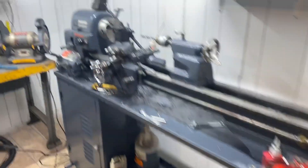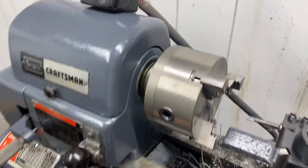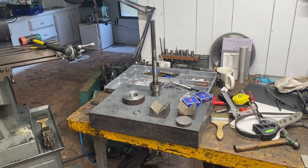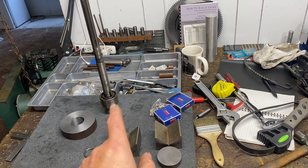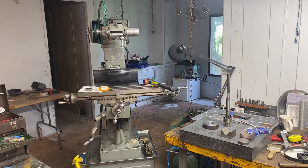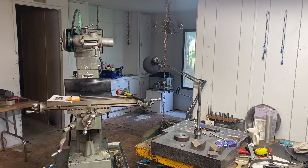I'm going to hop in and make this spacer really quick on the lathe, then work on getting these bearings off and the new ones put on. Everything's going pretty well so far - we'll see how this turns out. Hopefully I can get rid of that 0.002" runout. Eric with the Secondary Machine - talk to you soon. Bye-bye.